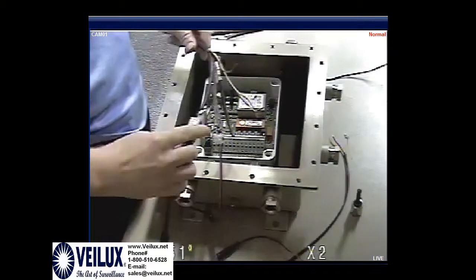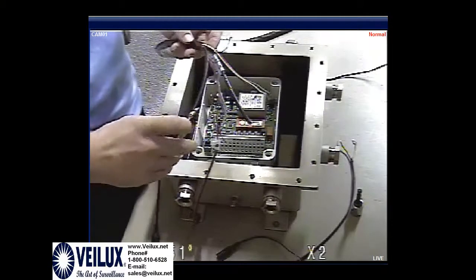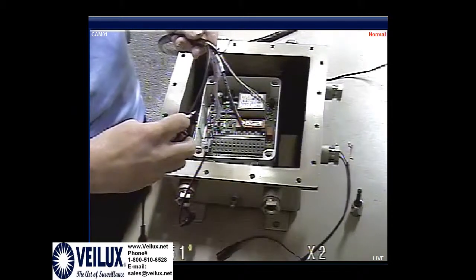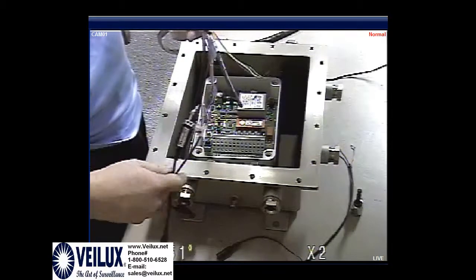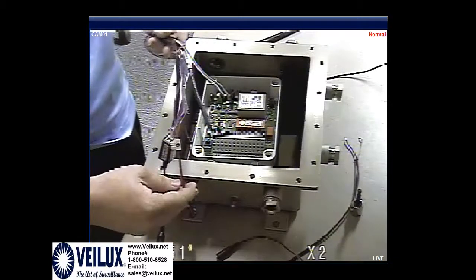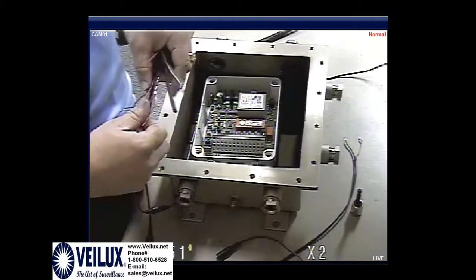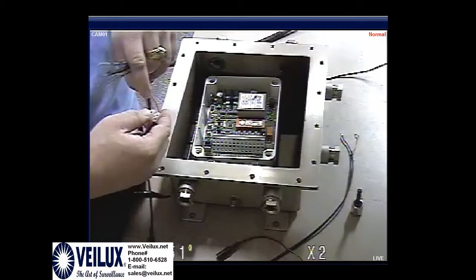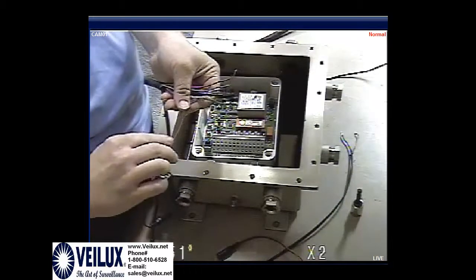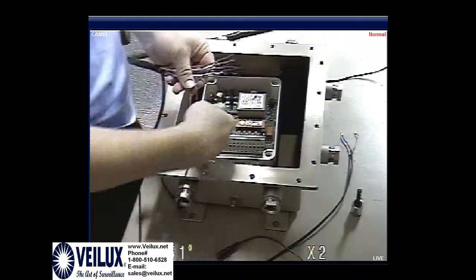So here we have our video connector with the balun. You will strip the coax cable, and then you would hook up the outside of the shield as negative, the middle of it as positive, and this would go up to the balun. We do have a power adapter here, a pigtail, to use 24 volts, but you can also plug in this pigtail, which is the thick brown wire and thin red wire, which is the power for the actual camera inside of the unit, into your 24 volt power that you have on your telemetry.